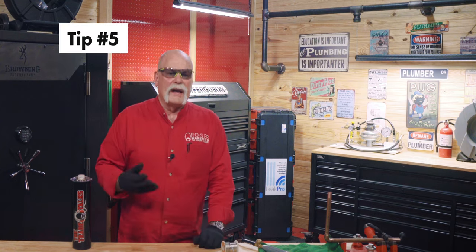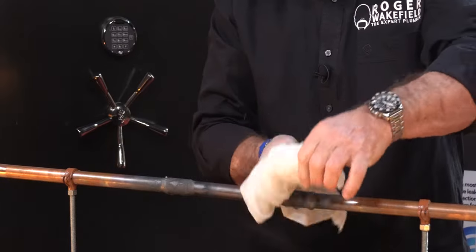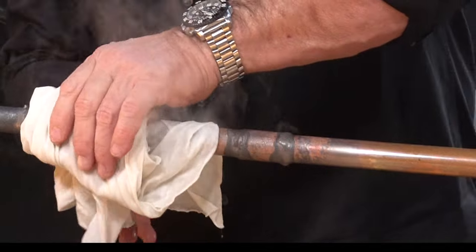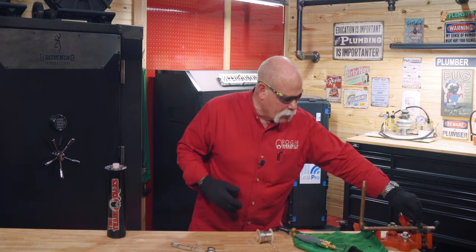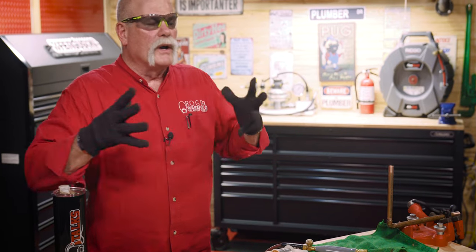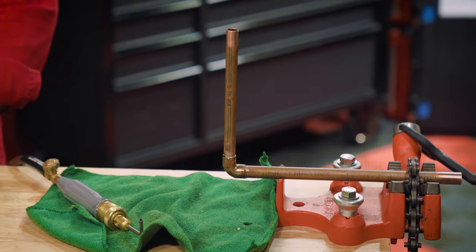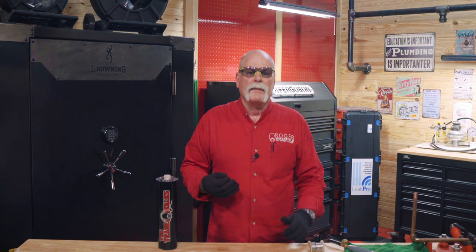You want to let this cool naturally. Quenching hot copper with water may lead to stress fractures or weaken joints over time. If you apply cold water — even if you start on the pipe and move up — you can cause expansion and contraction that may cause this fresh solder joint to actually get micro-fractures in it that are going to cause problems later.